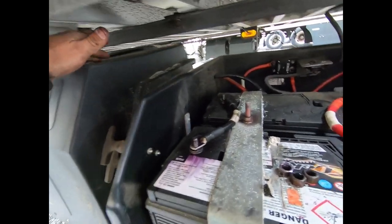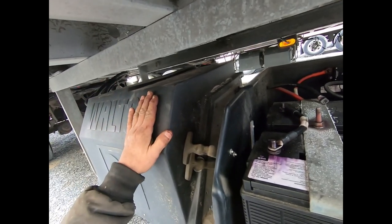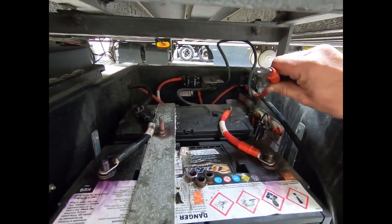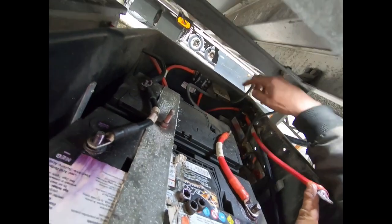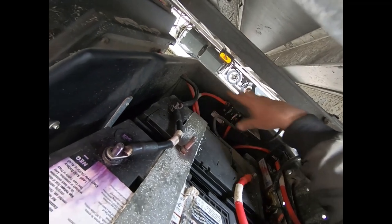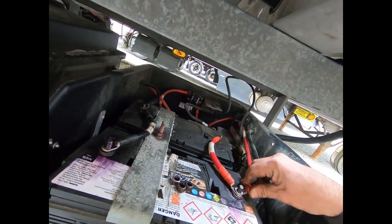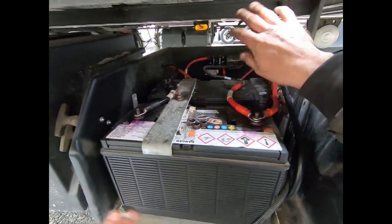We need the output out to the pump box. This short wire is the negative - it goes to the manifold block where it gets grounded, and all the other components in there are grounded through that cable. The positive cable goes out to the pump box - tracing it out, the first thing it goes to is the master disconnect switch, which shuts off power to the pump box. From there it goes into a 150 amp breaker protecting the battery box, then out to the pump box. As it's hooked up right now the liftgate will work, but without the charging system hooked up it'll work only until the batteries are depleted.